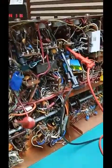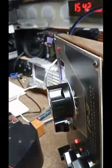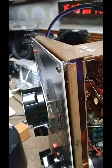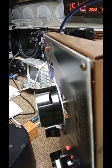And repeat as necessary to get it exactly right, because this is ultimately what controls the power output from the transmitter. When it's aligned correctly, you'll notice that when the alignment load is put on the input, the frequency in the speaker doesn't change much. Not much of a frequency change when the load's put on either side.